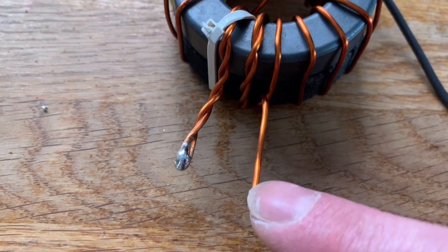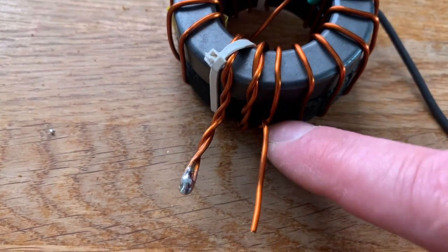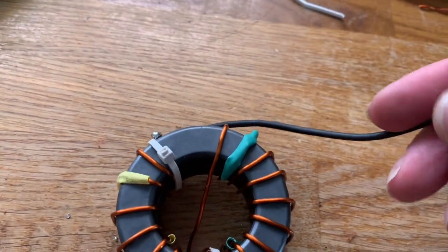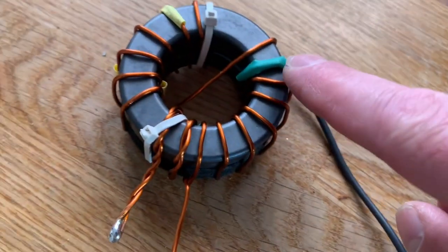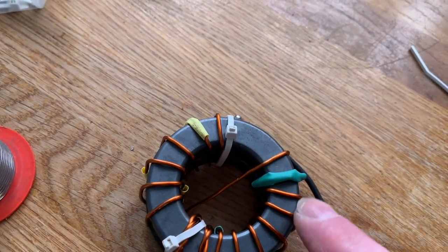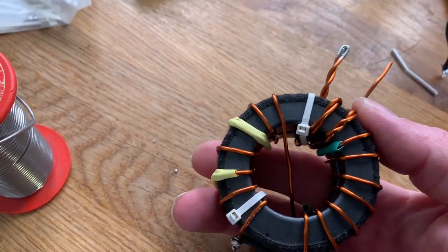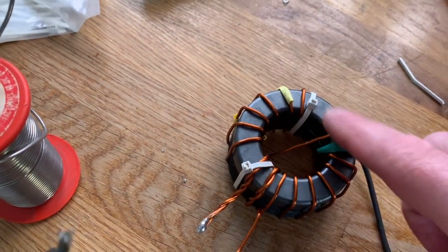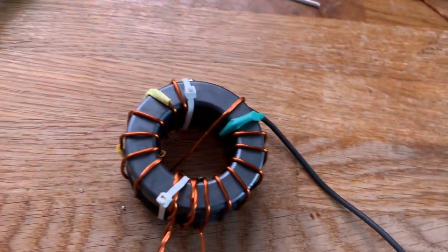Centre pin, ground or earth — two turns before it splits out here and carries on for 14 more turns, and then that's where the antenna attaches at the top bit, and this is where the antenna will go on the end of this bit of cable. This is where the insulation had come off the copper wire, so I just decided to put some heat shrink on it. Ferrite doesn't conduct anyway, so it's an insulator, but just to be sure you don't get any arc over.